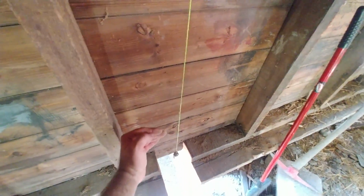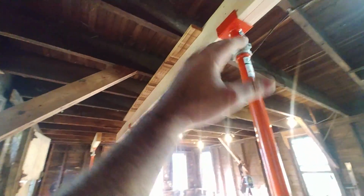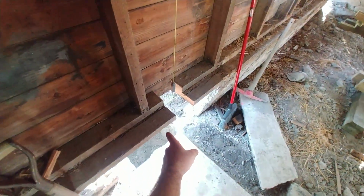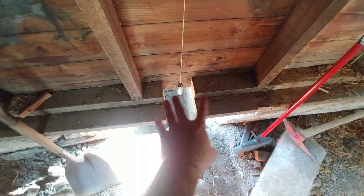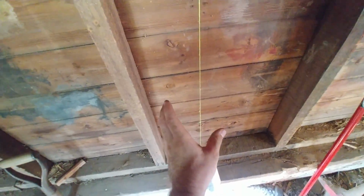and I'll continue to drive away, pulling at the bottom, until I pull that 3 inches out, whatever it ends up being, and I'll be checking the wall out there for plumb until we're at plumb. Then I'll put the machine in park, and I'll come in here and back this lifting arrangement back down until the post comes back into contact with the footing, and it'll be ostensibly plumb in here because that bracket and this notch are tight, and it'll be so close to plumb that I can beat it with a hammer after it's been nailed and everything, and kind of massage it.